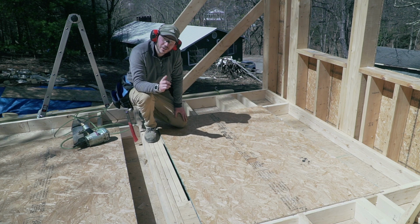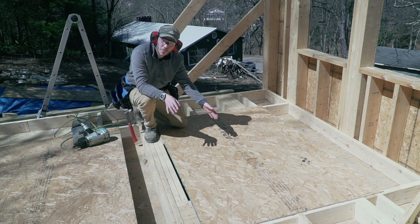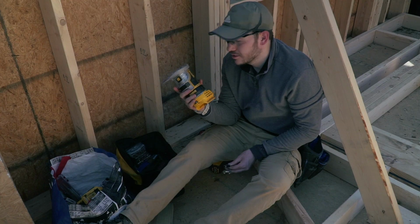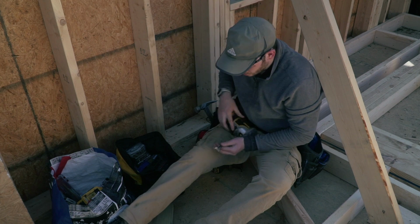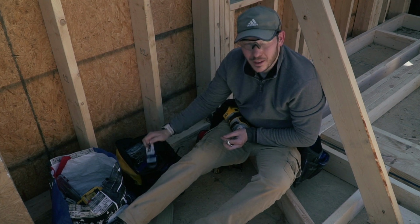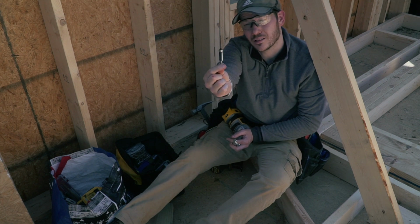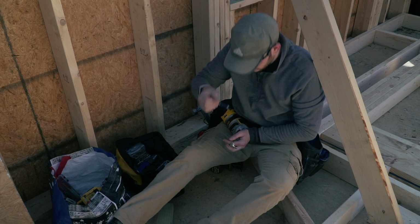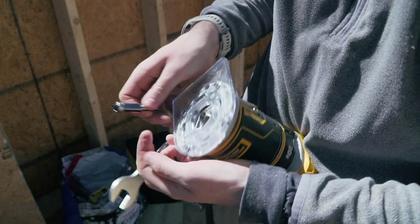Well, I don't know if I got smarter or lazier, but now I'm gonna use a different technique to cut off the opening after the sheathing has been installed and secured in place. You did see that I had a router now, and you probably saw other people using it for that. So you just have to get one of those, what is it called? It's a trimming blade, and it has a little round at the end, which means that it's gonna be touching the wood and cutting everything out. So that's what I'm gonna be using to cut my openings. First time using this blade.